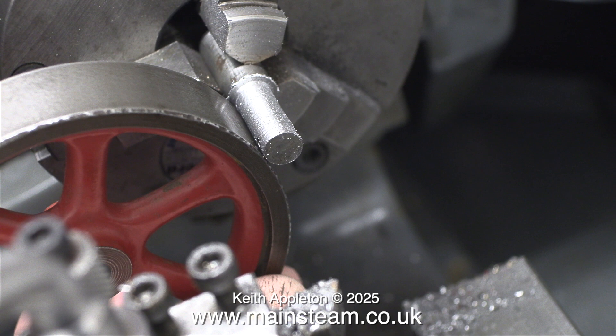Chilling is when the casting cools too quickly in a certain area. Chilled parts are very common, particularly steam chest covers and the corners thereof. One solution is to use a grinder on the chilled areas, which I'll show later. Once upon a time I used to obsessively read the writings of Curly Lawrence, LBSC, a model engineer. I remember from many years ago reading an article where he said the best way to get rid of chilled castings is to put them in a domestic coal fire and leave them there. The temperature isn't hot enough to melt the cast iron, and when the fire dies out and cools very slowly, the chilling disappears. I can't verify this because I've never done it, but I would trust the teachings of LBSC.